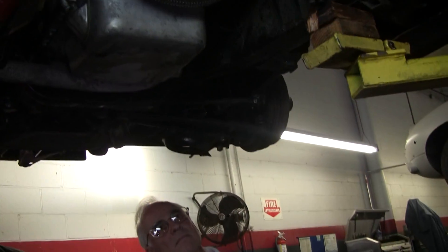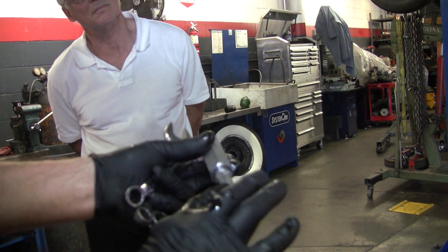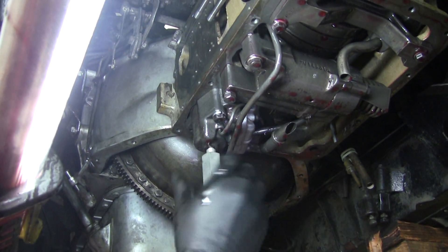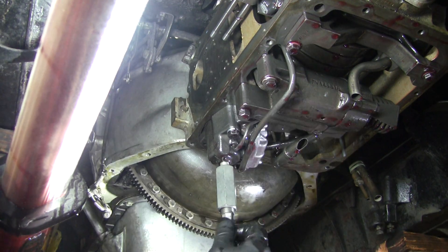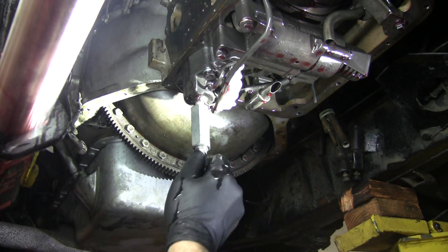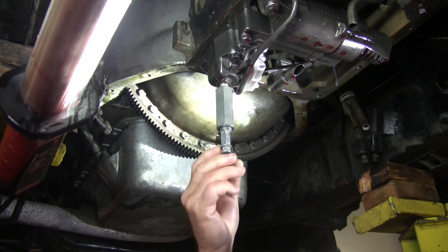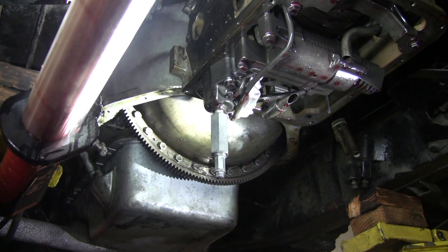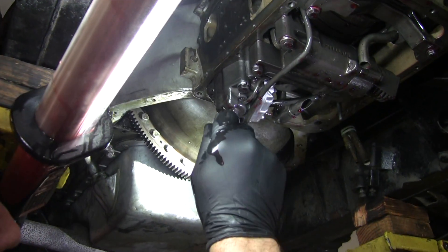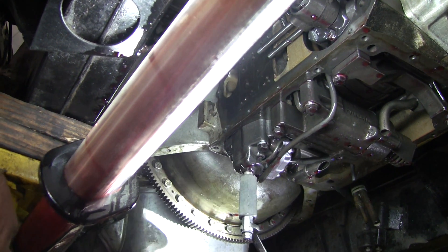You take this tool — this is an adjuster here — there's a spring in there and don't touch any of this stuff, don't mess with it. This thing screws into this hole until it bottoms out hand tight, so this outer housing is tight. Then you can run this up — somebody can try that — until you feel resistance. You turn it and you'll feel resistance when you hit the piston. Okay, so once you hit that piston, the book says five turns but I say three and a half. You turn it three and a half turns: one, two, three and a half.